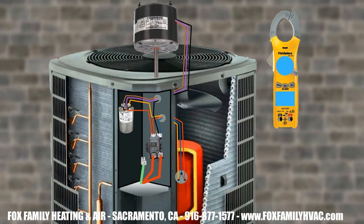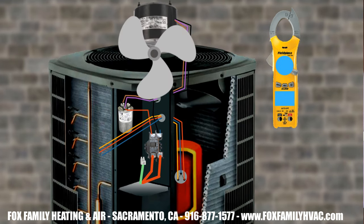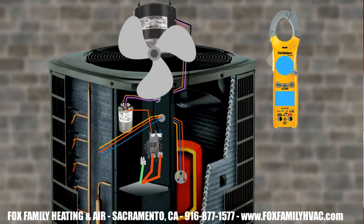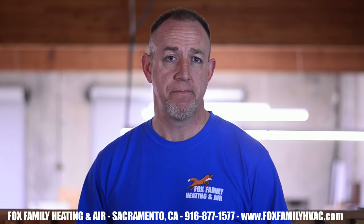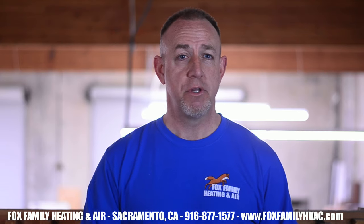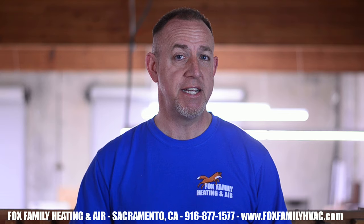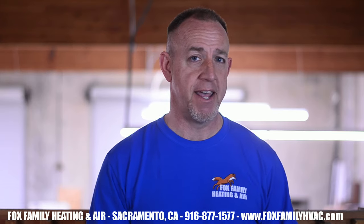Let's try bypassing the compressor. Remove the wires from the compressor altogether and just run the outdoor unit with the fan only. If the fan works, great — you can move on and you know it's not the fan tripping the breaker. If the fan isn't working, troubleshoot it. You may have to replace the fan motor, cool down the compressor until the unit is ready to run again, and retest the system. Rarely do I ever find that the condenser fan motor and the compressor will have gone bad on the same day, but I guess it can happen.